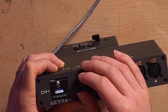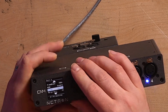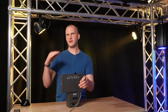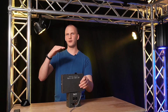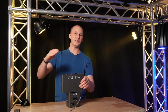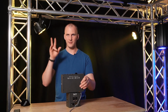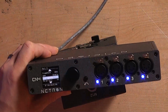And then backup, okay? With any of the merge options, if I go in, say backup, I like backup a lot because backup essentially gives you a priority. You say this console's priority and this one's your backup, so that whenever the priority console's on, whether that be your actual console or your console versus a guest console, your console versus a house light system, whatever, it just allows one to always be the winner if it's on. And so you turn that on and you have some settings.